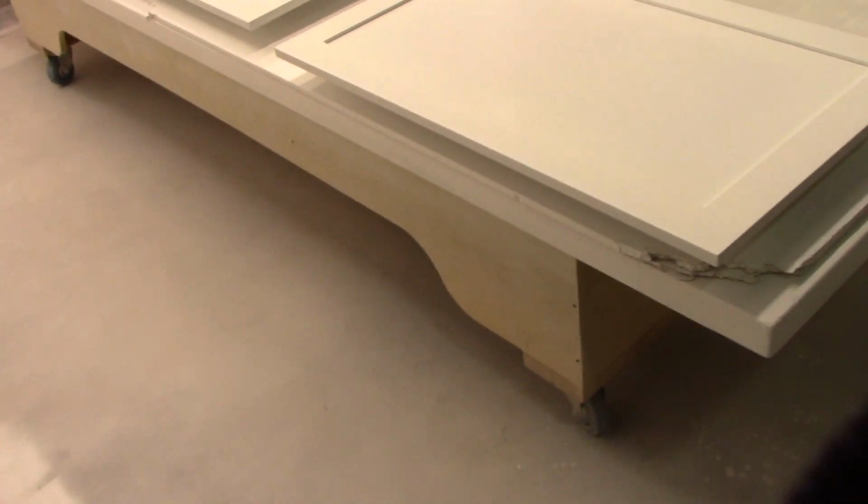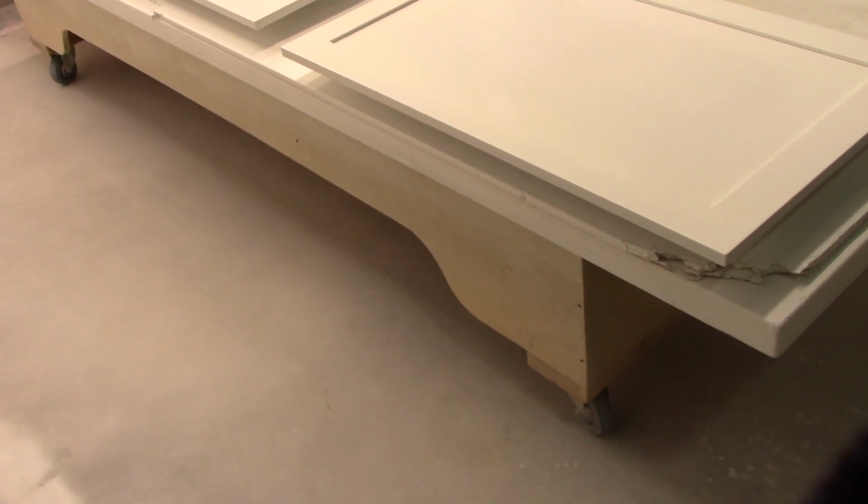But I'll come back before I put the finish coats on any place where I've sanded through this sealer and show a little bit of bare wood, then we will go over and recoat that with primer. Now these have had the edges done. Let's look and maybe we'll see some spots. Yeah, I don't know how good you can see. Right here, Walt did sand through just a little bit, okay? He's got a good feel for it, Walter, one of my guys. He does it pretty decent.